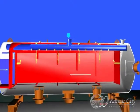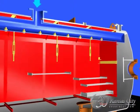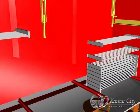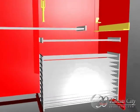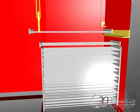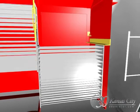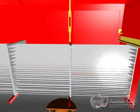The second stage of deaeration is the tray stack, through which water descends and steam rises in a counterflow fashion. Our deaerating trays produce a thin film of water, maximizing steam contact area and easing the stripping process. Trays are installed in our robust hold-down system, which is user-friendly, requires no special tools, and solves one of the major pitfalls of deaerator operation – tray upset.